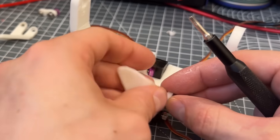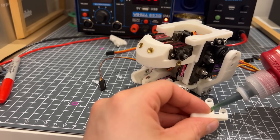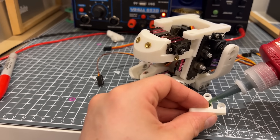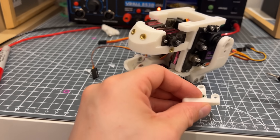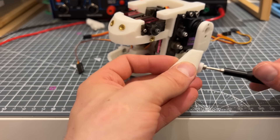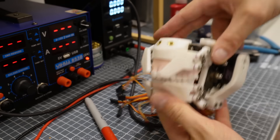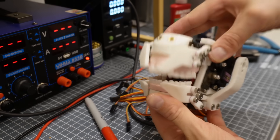I did have some issues with the design. Firstly there was a little bit too much variation in the 3D printed parts, so some of the screws didn't have enough available depth to thread all the way in without clamping down on the pivot point, so I had to wind back the threads a little and use some thread-locking compound to keep it together. The other issue with these shoulder bolts is that they're really expensive — something like £2 per screw — and I only realised after I finished the design, so unfortunately they are the most expensive part in the design at this stage. I do like this design a lot overall though; it feels tough.